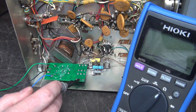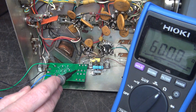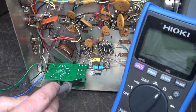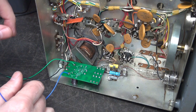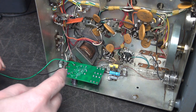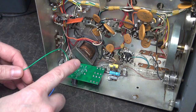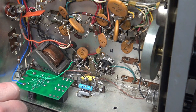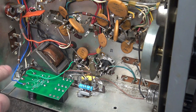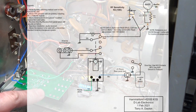This half of the switch we're going to wire the other way — it will be normally open. The ground also goes here and this line will go to your antenna input jack. At the same time that the first contact opens, this one will close and short out your antenna terminal coming in, to protect the front end from RF. That leaves us with three wires: the blue wire goes up to our new RCA jack, the black wire is ground and I'll tie it to that ground tab, and the green wire is filament voltage — we just need to steal that off one of these tubes.